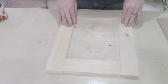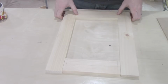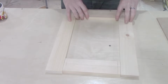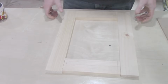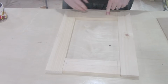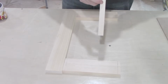Now, when we're talking about the width, it's important to take into consideration the amount of wood that is going to go into the stile itself from the rail. In this case, it's going to be 3/8 of an inch on each end. And if you notice, I've already got it marked 3/8 of an inch on each end, the part that's going to be cut. That's an important consideration because when you cut that part off and you slide it into the stile itself, you're essentially taking 3/4 of an inch off of this total distance. So whenever you cut your rails, always make them whatever the additional length is that's actually going to go into the boards itself. For these stiles, there will be a groove that is cut all the way down that is 3/8 of an inch deep.